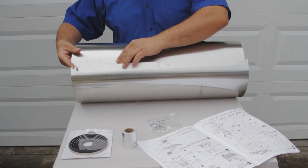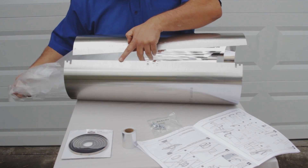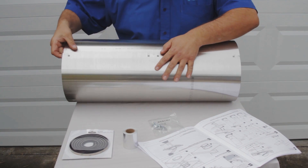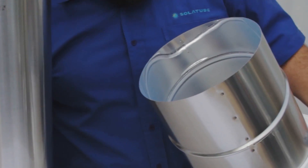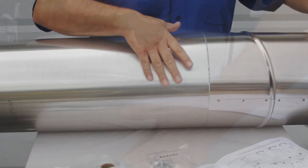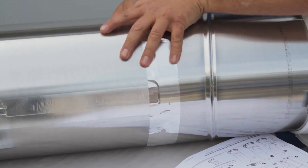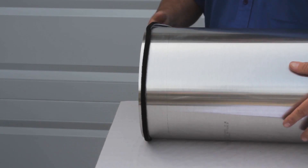Using the recorded measurement, determine the required length of the extension tubing and assemble. Remove the protective liner from the tube interior. Create a tapered tube with one end larger than the other. Assemble the extension tube by securing the notches in the middle and at both ends. Apply foil tape along the seam and press firmly to complete the seal. Remove the protective liner from the bottom tube assembly. Then insert the small end of the extension tube into the bottom assembly with the vertical seam on opposite sides. Insert three evenly spaced screws to secure the tubing. Tape the connecting seam and apply pressure for a complete seal. Attach the expansion joint seal one quarter inch below the top end of the extension tube assembly. Repeat these steps for the secondary unit.